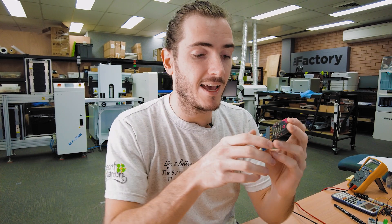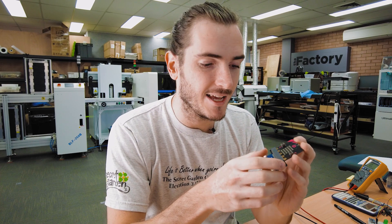This is a very manual test. It's fine for a first production run of 100 units or so, but for more mid-scale manufacturing — if you're getting into 500, 1000, 2000 of these boards — having to test it like this is quite error prone if you do it a lot, and it's just not very efficient. It takes a long time to beep out all the connections.